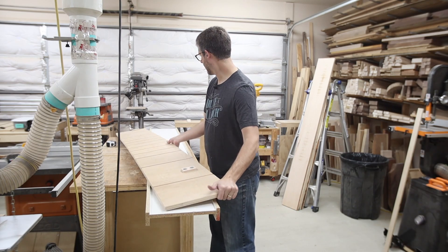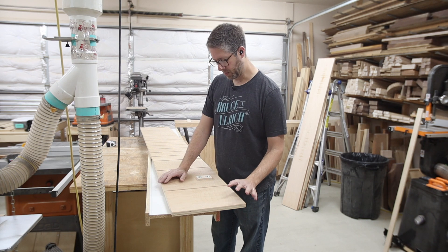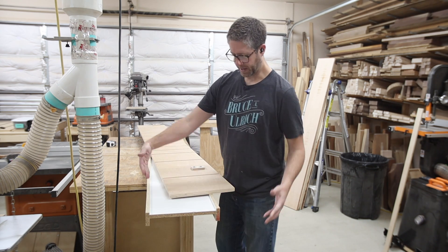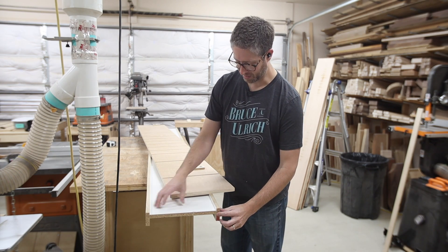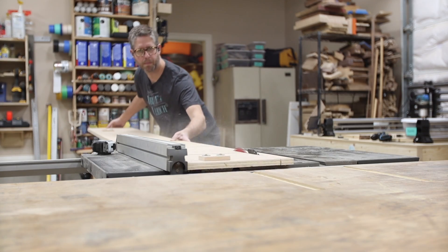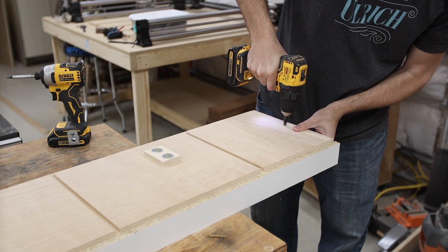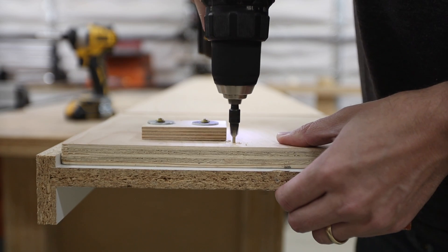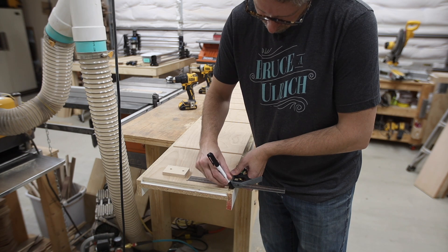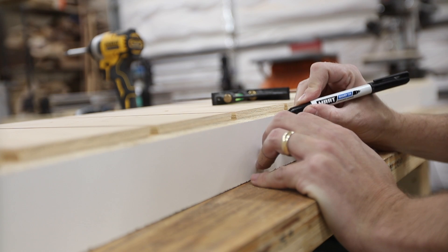The I-beam is all done. I was originally making this sled as wide as it could be to fit through my planer, but because both sides of the I-beam also have to fit through, I had to make it a little shorter — I lost about a half inch in the dados. Still not a problem; I can get over 11 inches, but I need to trim this sled on the table saw for a zero clearance fit. Then I secured the plywood sled to the I-beam with three screws and marked the front, rear, and screw locations with a sharpie for future reference.